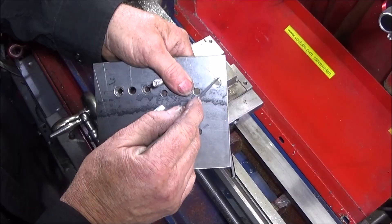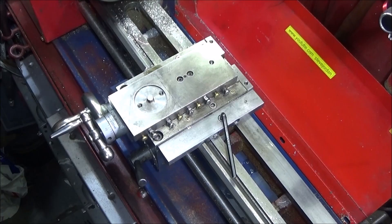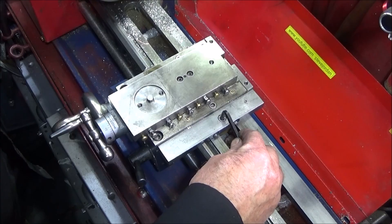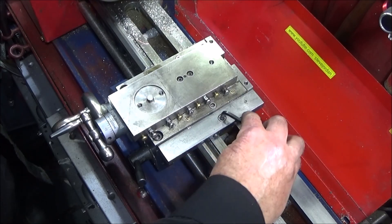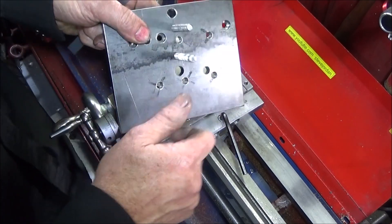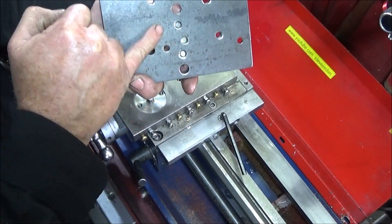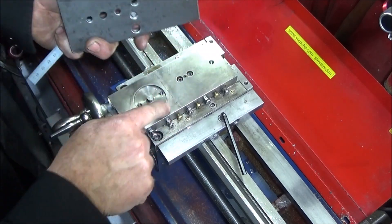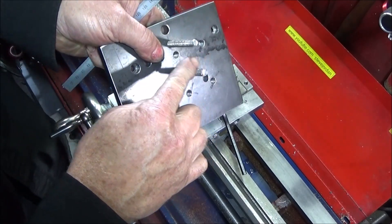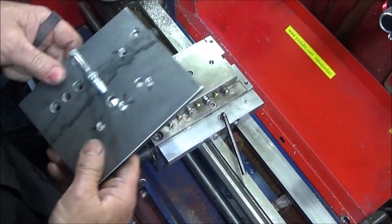I also drilled through this one with a six millimeter drill. I reassembled the lathe and ground this Allen key to a certain height so that it just drops into the six millimeter Allen bolt. When I put this one on I always make sure the studs are screwed up to a certain height so they don't protrude through the other side — otherwise when you bolt it onto the cross slide you can actually dent it. I'm waiting for some stainless steel studding and when I get that I'm going to put those to a certain depth and lock them in with Loctite 638.